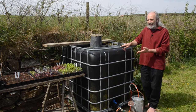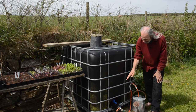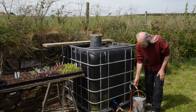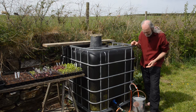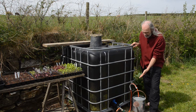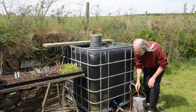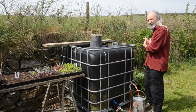Since the tank is on the ground, we use a little pipe arrangement to get water out. As long as the water is above the level of the top of this bent pipe — bent using a washing-machine pipe-bender — it will fill a watering can. It also acts as a safety element: when it stops filling, we know our water level is down to about 40%. We could drain more by dropping the hose lower or running a longer hose downhill. We've fitted a tap with two outlets — one for the hose in use, and another outlet ready for a future attachment.